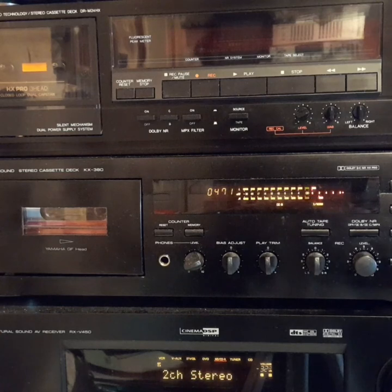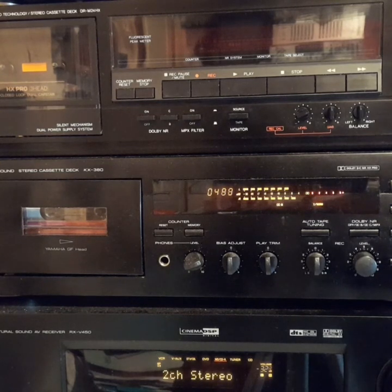If your speakers are in phase, the first example should have sounded fine with a firm central image. If, however, it sounded like that the second time, when the music was deliberately recorded out of phase, your speakers are incorrectly connected. This is easily fixed. Just reverse the connections to one speaker only and replay the section again to check. And just to refresh your memory, here's the music once again recorded in phase.